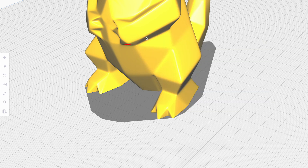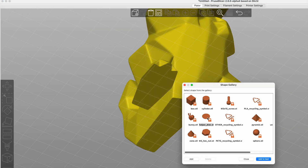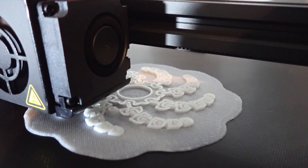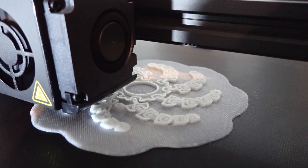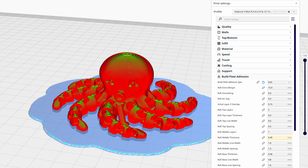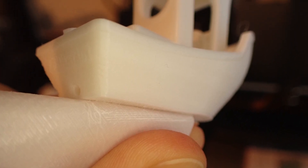If you don't want to create mouse ears manually in a CAD program, there are handy solutions for most slicers. In Cura there are practical plugins with which you can place these mouse ears manually or automatically. In Prusa Slicer, mouse ears are called helper disks and can be placed in a similar way. A raft, on the other hand, is essentially a new print bed for your object — it consists of a few layers printed between the print bed and the object, activated with a button in the slicer. The disadvantage is that rafts often leave marks on the object, so they are best considered emergency solutions.